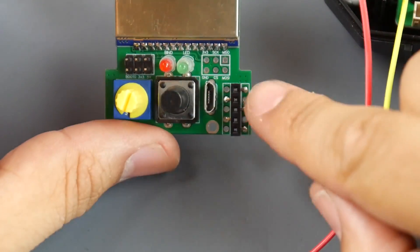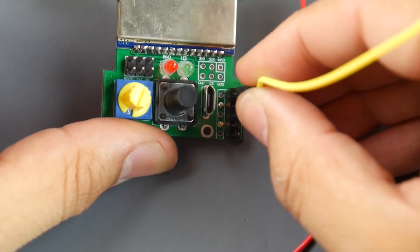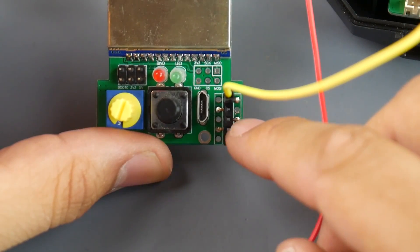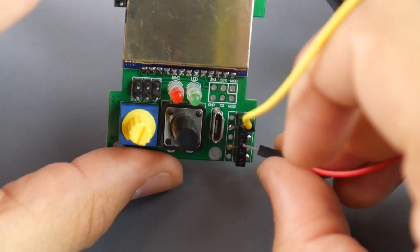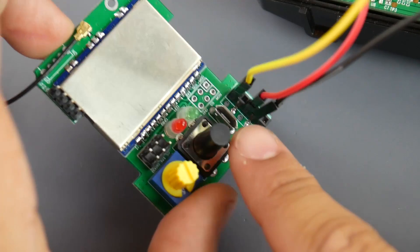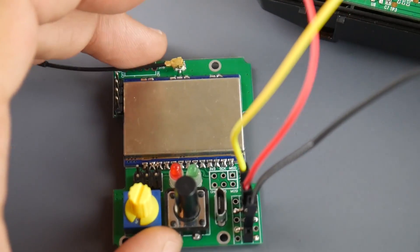On the multi-protocol module, which pin is which: the top pin is PPM input, the third pin down is VCC (5V), and the one just above the bottom is ground. So we have PPM, 5V, and ground — beautiful.